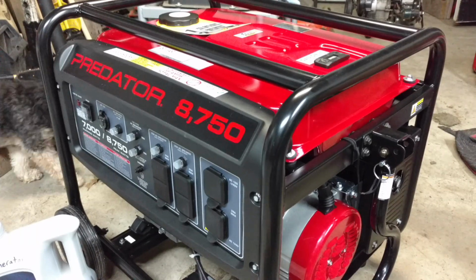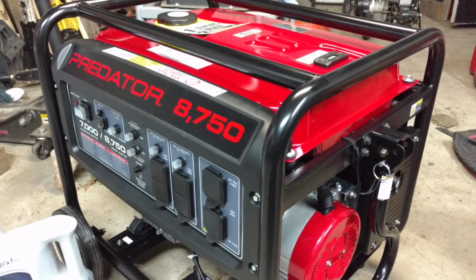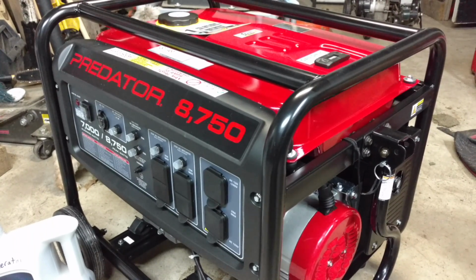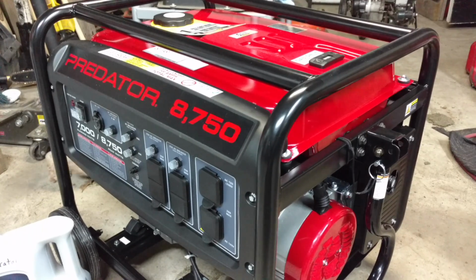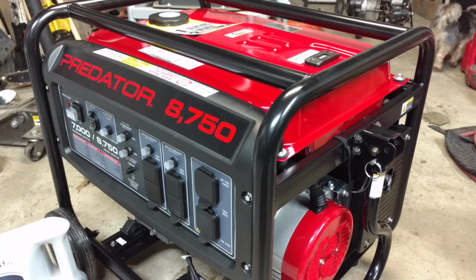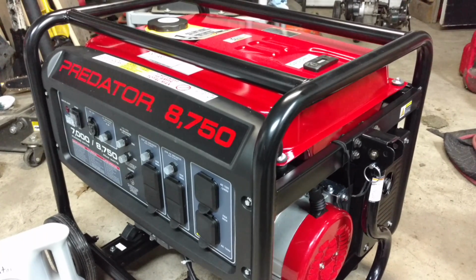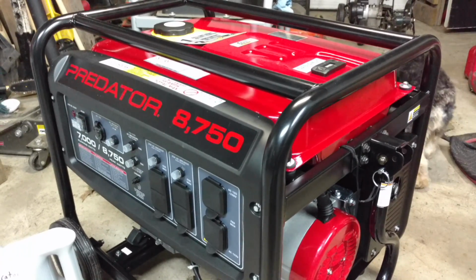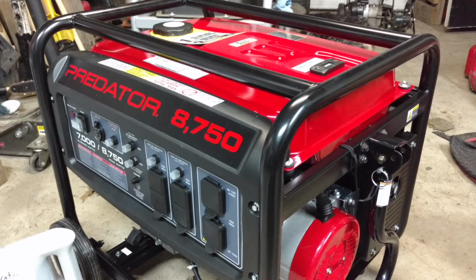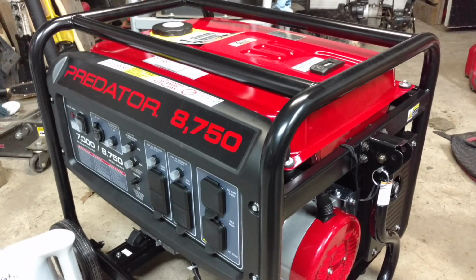you might want to take the extra step and either invest in the aviation fuel with no ethanol, or I think I'm going to go and purchase some Startron. I've been reading the reviews on that. Startron Star Bright fuel treatment, and it's got excellent reviews. It's supposed to be some of the best stuff on the market, and I think that's the route I'm going to go, because I work on this stuff. You know, I know what happens when it sits.